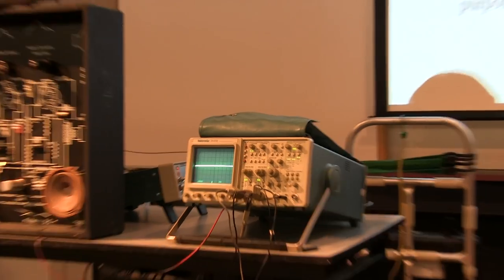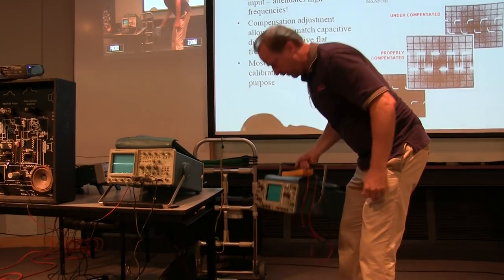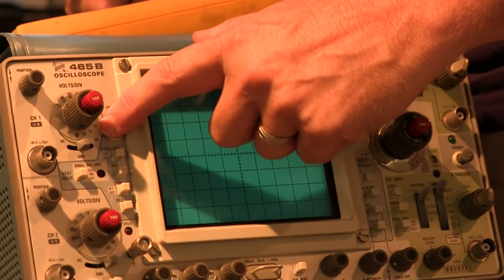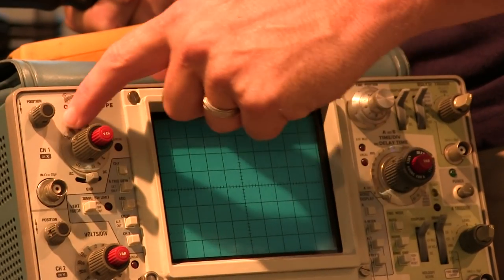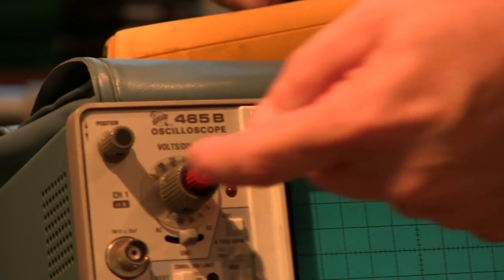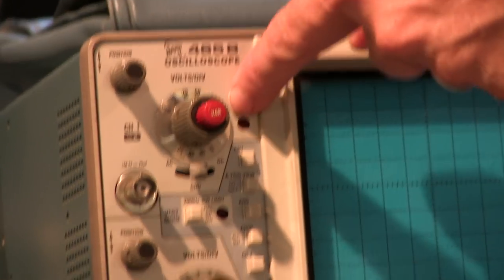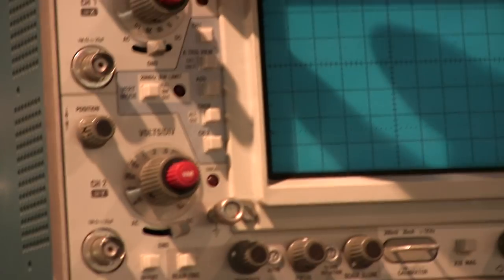If you look at the scope like this, focus on this one, Bob. There's actually two little lights that light up. I don't have it turned on. These scopes will actually sense whether it's a 1X or a 10X probe, and it'll light up the number under the skirt appropriately. And the way it does that, if you look at these scope probes,